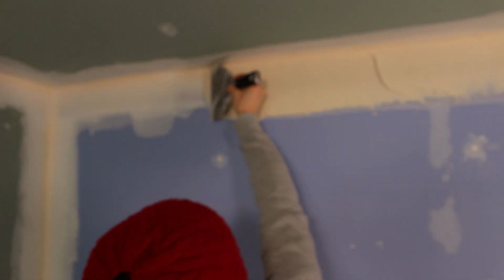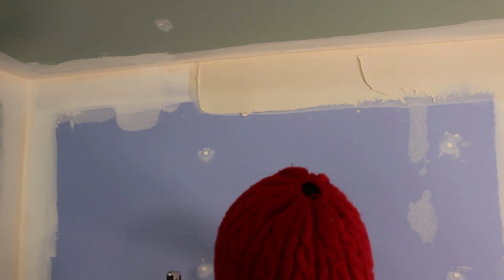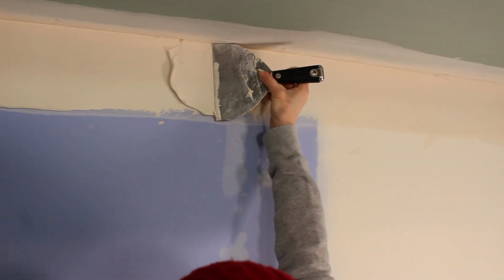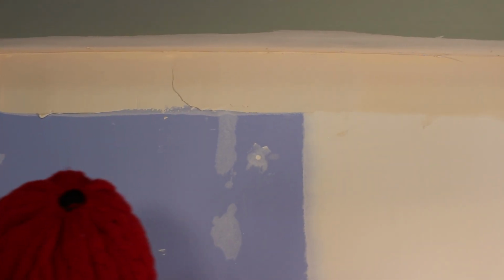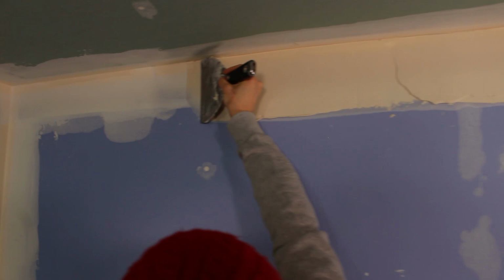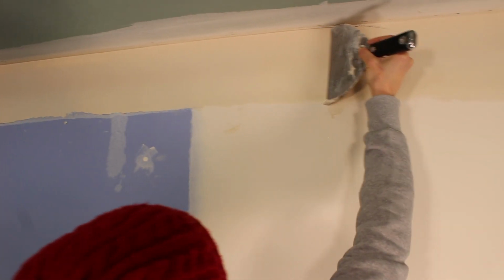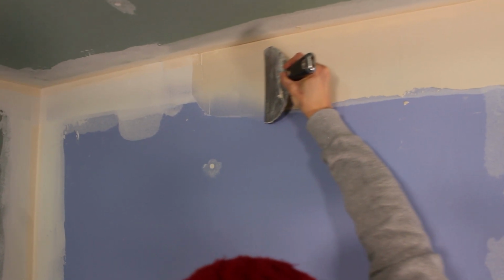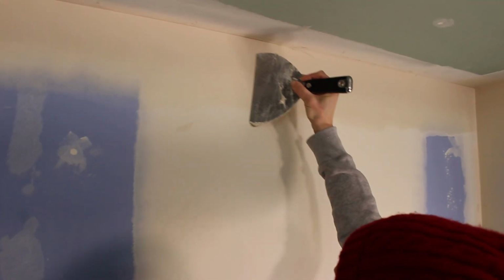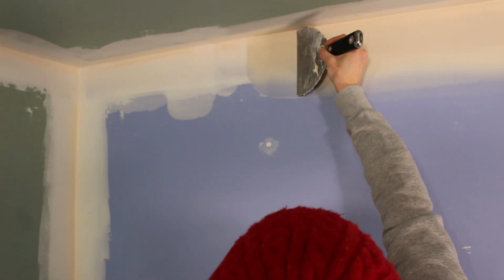Okay, perfect. And then I can wipe. Go over it one more time and get the mud even, one consistent thickness, but a little heavy, so that you can do one more wipe and then get it perfect. So get rid of that blob. Now go over the whole thing once. Make sure to stay in the inside corner. Don't fall away from the corner. Then blend and go light, light, light. Now cut that bottom edge. Perfect. One more time, stay in the inside corner. And when you finish and blend into my work, just lighten it up.